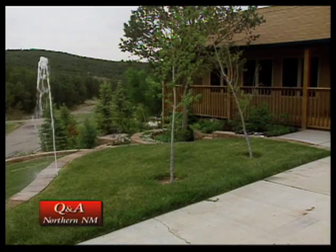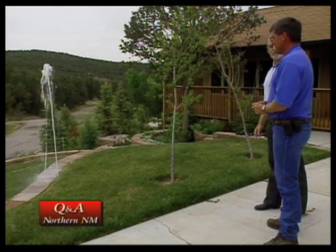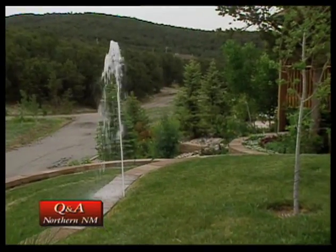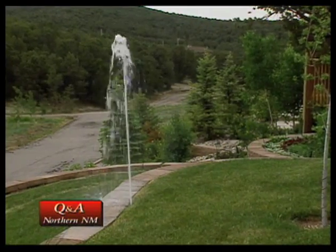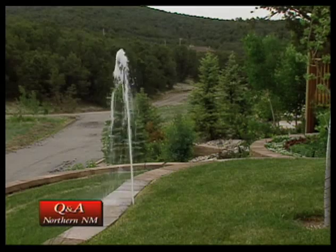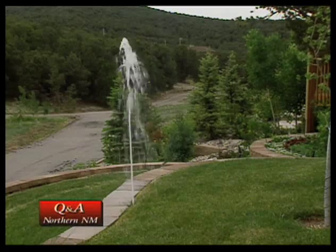Well, Willie, that's easy to see. I can see we've got a geyser here. That's a good reason to turn it on. Yeah, it sure is, Curtis. That's putting out probably in the neighborhood of 15 to 20 gallons a minute, and that's just one down the street. With that geyser and the system that is installed here, none of the other heads will pop up, so pretty soon you start getting stressed in this turf area, and the area just below that geyser will be nice and green — or fungus. Well, let's fix it.